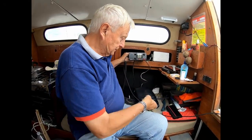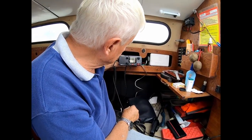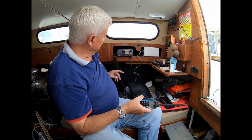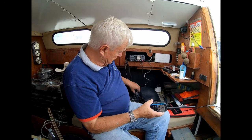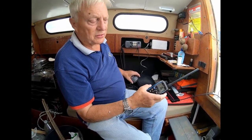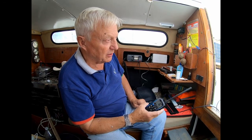One two — volumes up. I've set the handheld to channel 16, set the radio to channel 16. It shows that it's receiving and transmitting okay through the antenna. With the local coast watch station we did a transmission test and they reported back readability five — so no problem with that on that little whip.